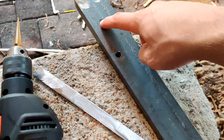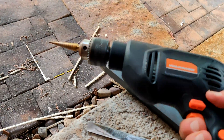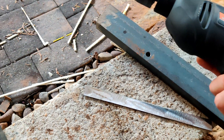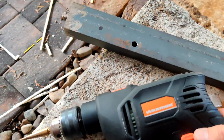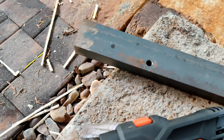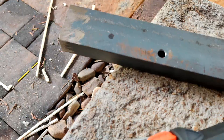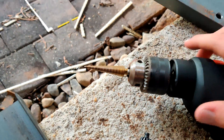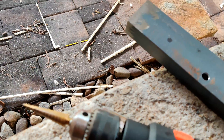I marked the other bolt hole on this support bracket for the half shaft and I have to drill it out. I have an impact drill from Harbor Freight — it was about $25 — and this is the kind of tool you want because it has a lot of torque, so it can cut through metal at slow speeds. You do want to go very slow because when drilling through steel, the bit and the metal both get really hot, and heat is what kills drill bits. These are stepped titanium-coated steel bits, $5 or $6 each. They do a great job of drilling through metal — you just have to be patient.